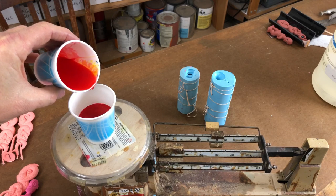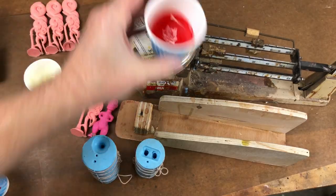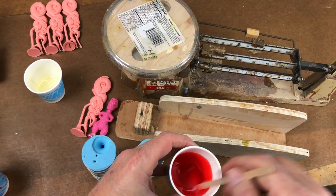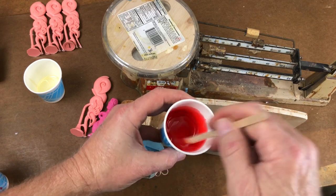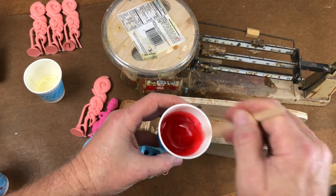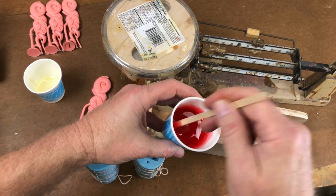We're at six, sneaking up on it. We're at eight, almost nine. Set it to 60. We're very close — just pour the last couple grams. That's the quick way to use a balance beam: dump in a big amount in the beginning, measure in increments, and then sneak up on it. Let's stir, stir, stir. Get these things poured. You don't have to super rush, but you've got to move on — this thing is going to come out of the molds in 20 minutes.